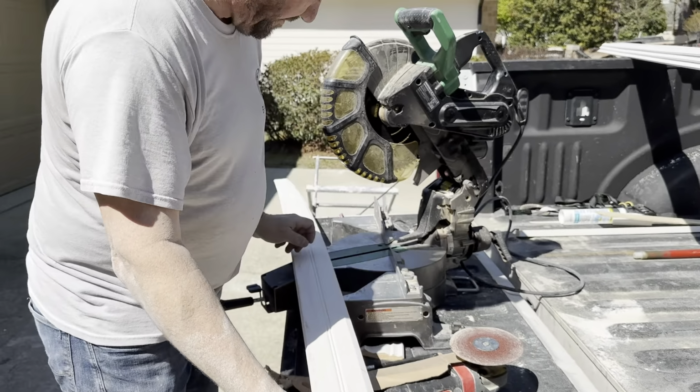I'm going to go here more because I can bring it in tight from the left side and have a little bit of gap at the left wall, because where the other piece of crown copes over it, we'll hide that gap.